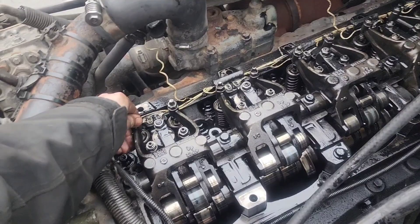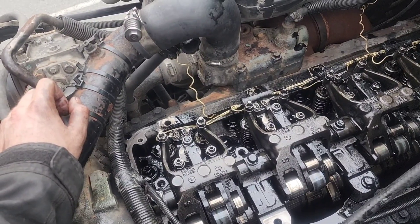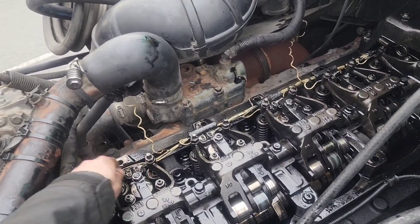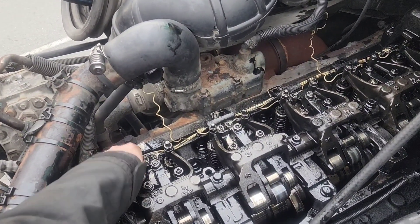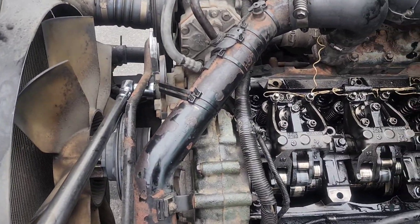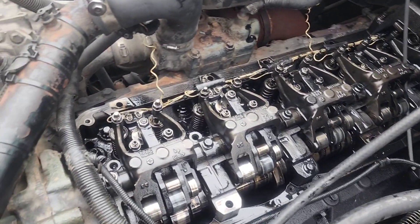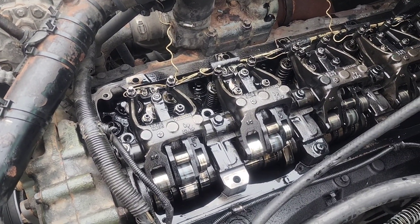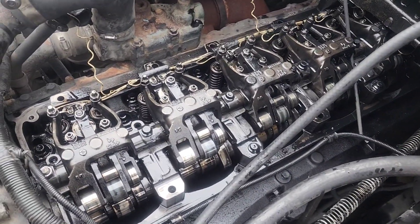The rockers are bolted down and torqued — everything feels good. Before slapping this all back together I'm going to check the valve lash on the exhaust valves. I checked all the intakes a couple days ago, so I want to loosen the exhaust ones just a little more — they've gotten slightly tighter from spec. I'll put that in a different video. Thanks for watching — please smash the like button and subscribe. I have more repairs coming with this truck — pretty much everything you could do to a Freightliner Century or Columbia. Until next time, this is Slim Diesel.